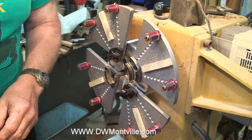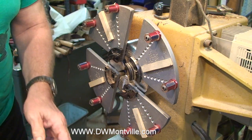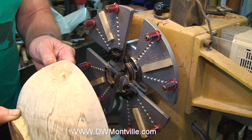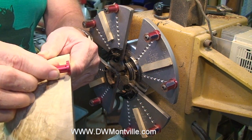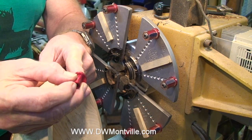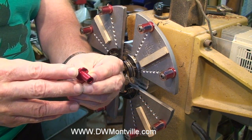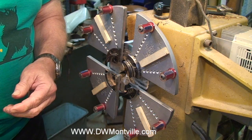When I made these grippers, it was intended to solve the problem of that lip. But when you're going to grip a bowl like this — where the edge goes right down to the surface, it's a nice almost square edge — if you go to use that with my grippers, you'll actually find that you're going to fall right on that edge, which is the support surface of the aluminum core of my gripper. You don't want to grip the bowl on that. That's hard aluminum and it's going to make little marks in your bowl. So here's what you can do to solve that.